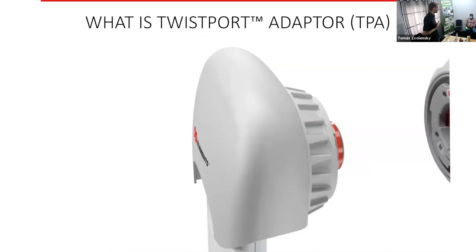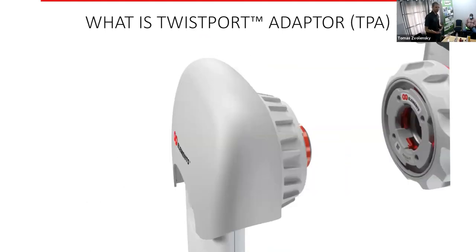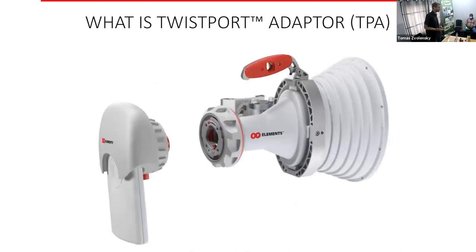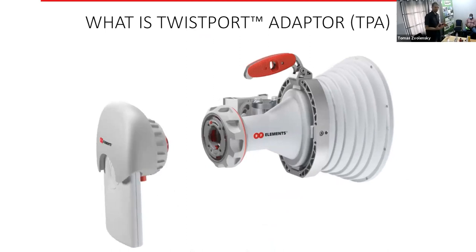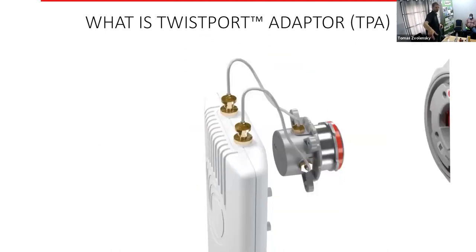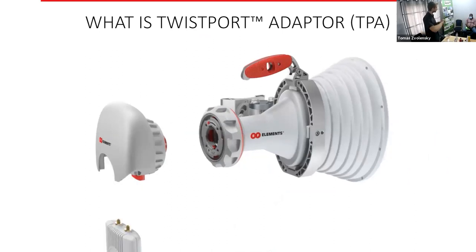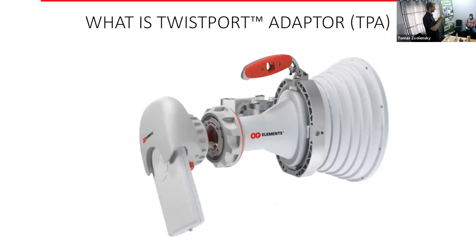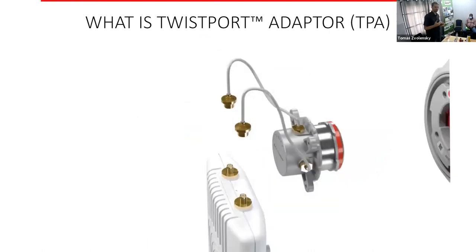Of course, we don't sell our own radio yet, so we have to support the brands that are out there. For those radios we have twist port adapters, which basically change the coaxial output of the radio into a twist port male output. Inside the adapter there are semi-rigid coaxial cables — you bend them and they keep their shape. Since we control the manufacturing and quality assurance, we ensure minimum loss. The cables are very short and enclosed in the plastic body, so users don't need to handle them at all.